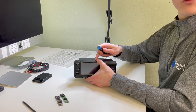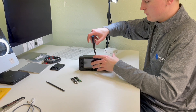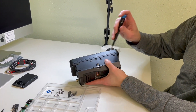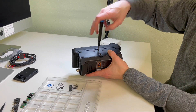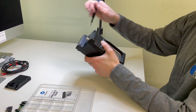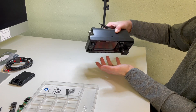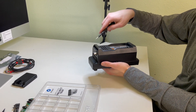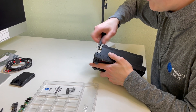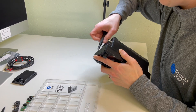There are two screws on the top and bottom to remove, and one on the bottom in between the tripod mounts. Then there are four screws on the back — two on each side. Be careful as you're taking these off because these hold the front panel on. I usually like to hold the radio facing down so you can catch the screen as it comes off. There are a couple of ribbon cables that hold the display in place — you don't have to take them off if you don't want to.